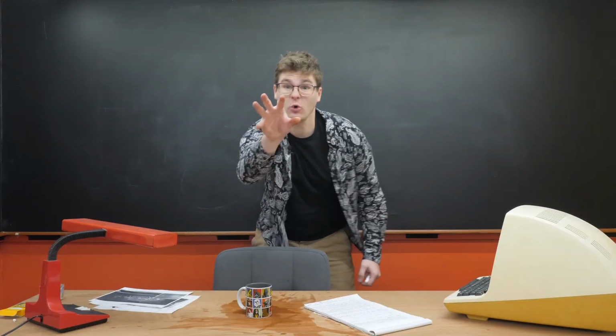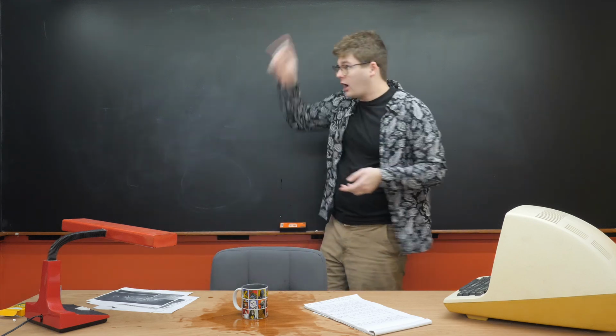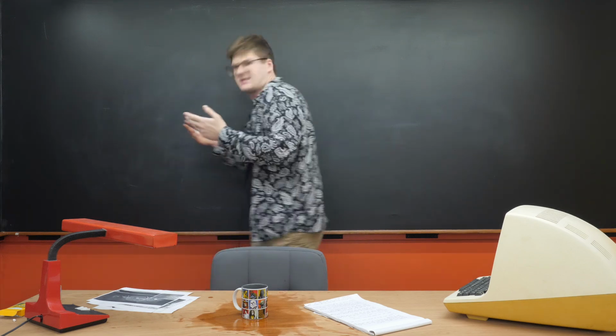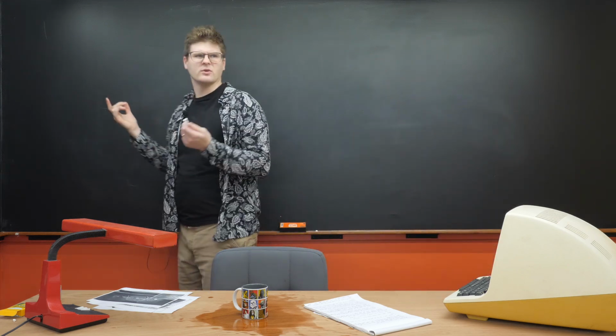Alright, let's get this sorted out! We're getting good speed data from the car because the values are going up and down in sync with the speedometer. So it's gotta be a data encoding issue? It's gotta be the way the data's encoded. It doesn't seem to be an offset issue, so it's gotta be a scaling issue.